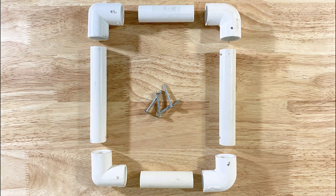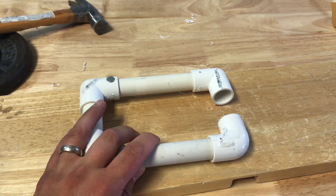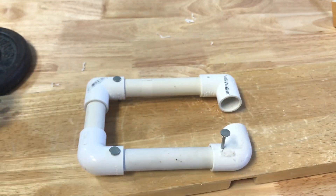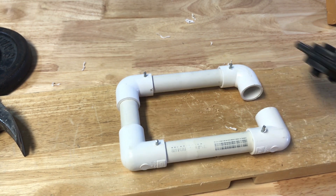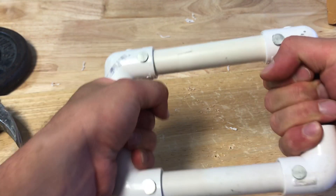The final piece is the counterweight. From the half-inch PVC, you'll need two pieces that measure three inches and two pieces that measure five inches. You'll also need four corner joints and four nails. In order to prevent the weights from pulling the PVC out of the joints, I drilled holes all the way through the corner joint and PVC after connecting them. I then hammered nails through and clipped them with bolt cutters. An alternative to this process could be applying PVC adhesive, but it is important that they stay secure so the weight does not come off.